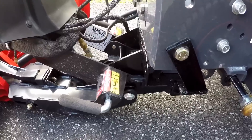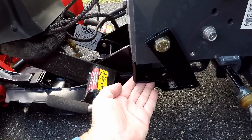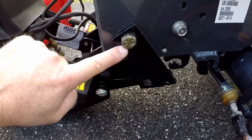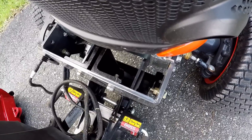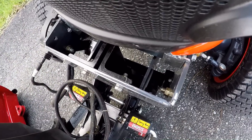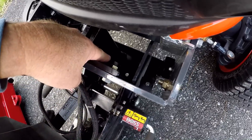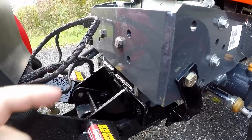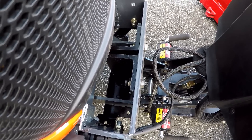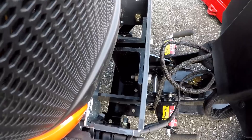The only thing left on the tractor frame will be this custom mount, which stays on the tractor. If you ordered the plow for the Kubota RTV 400, you'd get this mounting frame and bracket included. You will need to weld on the L brackets and side bracket to fit your BX tractor. Looking down the front, there are four bolts mounting the plow frame to the tractor frame, and you can also see the heavy duty angle iron welded onto the plow frame for support. The angle iron is also welded to our plow frame but not to the tractor frame.